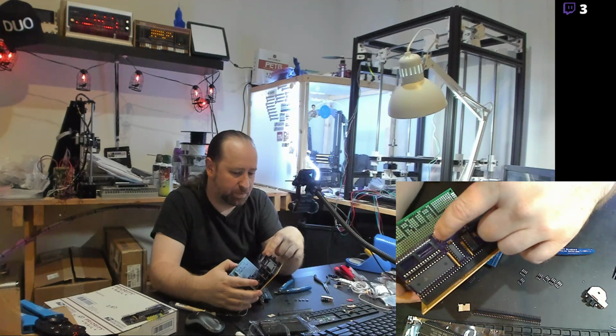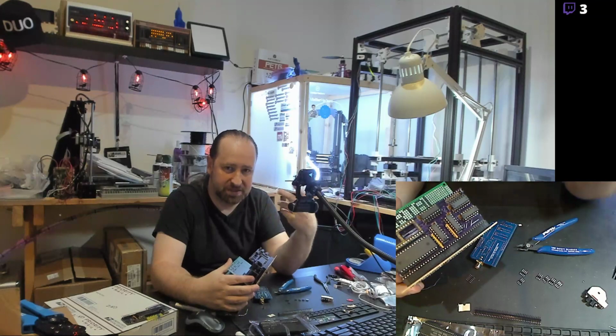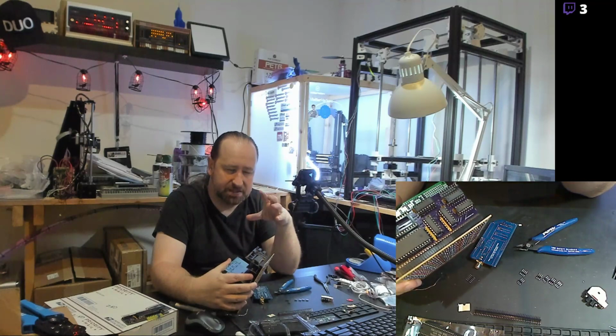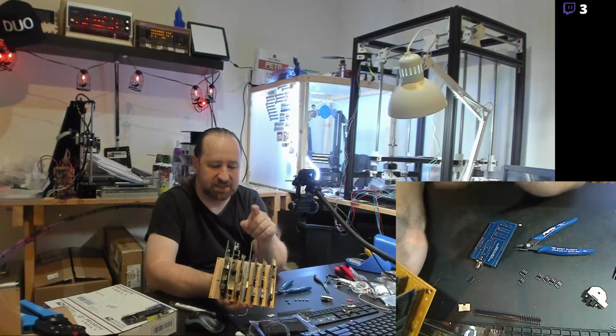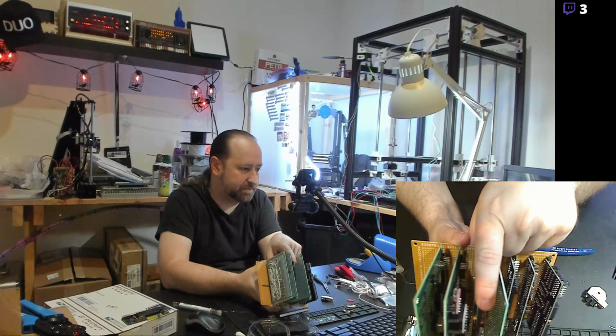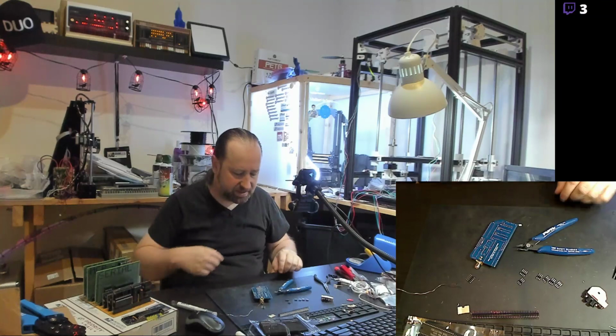The ROM is 128K. The ROM includes a basic operating system or a CPM operating system. So you can actually boot it up and it runs like a basic command prompt or a CPM prompt. CPM was the precursor to MS-DOS, so if I run CPM on this, it looks a lot like DOS, operates like DOS. CPM can actually access the compact flash card that's in the center of the board here. That's too small. Surprisingly enough, you can do a whole lot in half a megabyte. And honestly, those things are a lot of fun. There's so many things you can get them to do.